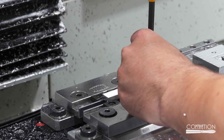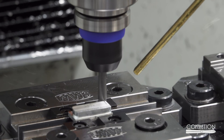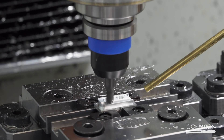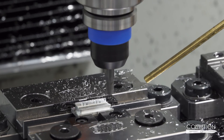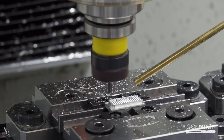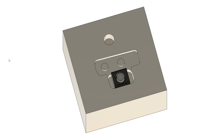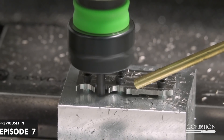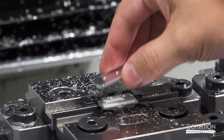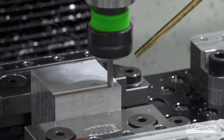I start by machining most of the part in the vise. I've been using steel to make prototypes and test programs before the titanium — I think steel is good for parts under more stress, but for parts like this I can definitely use aluminum. I cut a dovetail, which is what keeps the scales in the handles. Unlike my last design I now have to machine a curved surface onto the part, which is another thing that has me worried about fixturing this part. I did make a small flat on the top but that goes away with the different textures I want to mill into these parts. This time I did it backwards but with some adjustment it fits. It's a little more awkward this way.